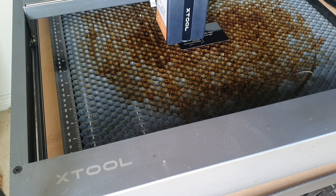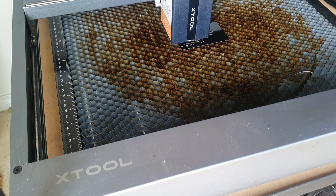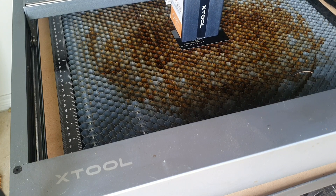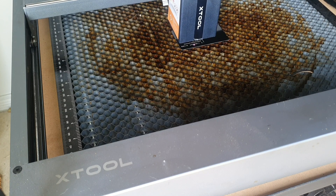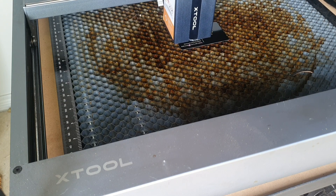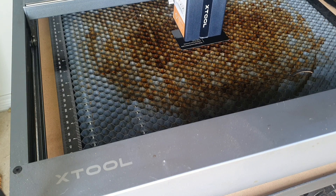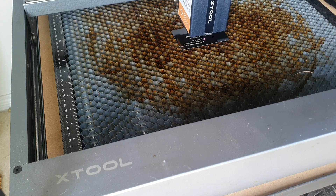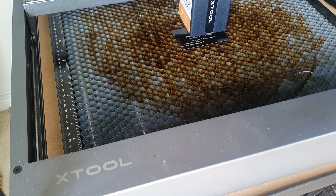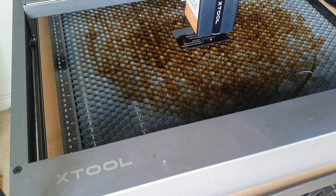You can also see that I really need to clean my honeycomb. For those that don't know — and I'll probably do a video on this — you spray it with degreaser, leave it sit for a while, and then blast it with a high pressure hose and all that gunkiness — it's like burnt glue and stuff — just falls off. I have done it several times. You can see I cut a lot of big circles because there's that outside circle line — just burning wood and burning glue.